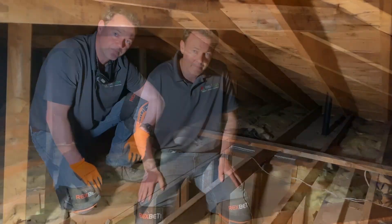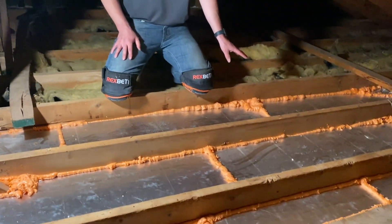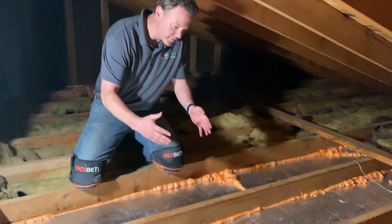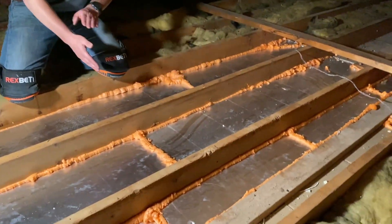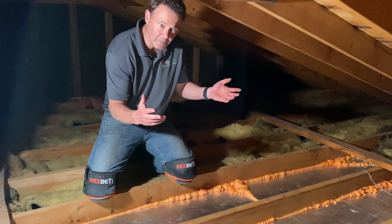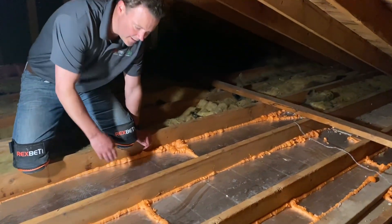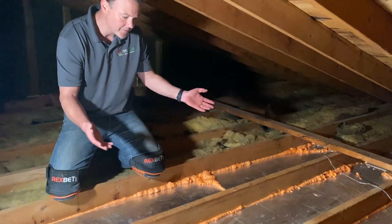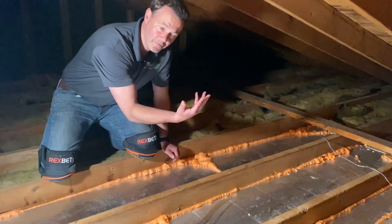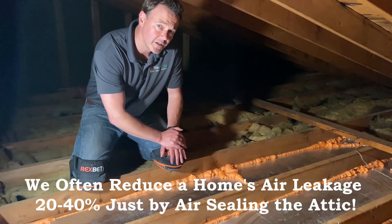We just finished air sealing the whole attic about 20 minutes ago. This was where the stairwell void was — directly above the stairs that go from the first floor to the second floor. When they built the ceiling parallel with the stairs instead of flat, it left a huge void with open stud bays venting conditioned air directly up into the attic space year-round. All we did is put a couple of reinforcement studs beneath it, and lay down one-inch-thick foam board — it's not designed to support weight any more than drywall is, but it will keep any conditioned air from coming up from below. This is permanent; we'll be able to blow 15 inches of fresh cellulose insulation on top of it when we're done.